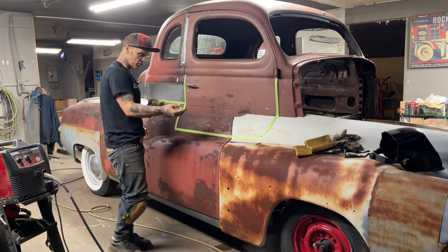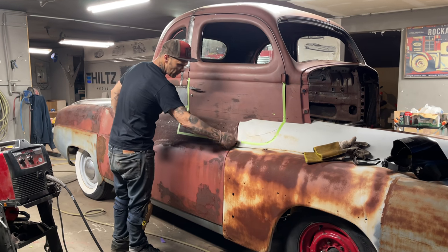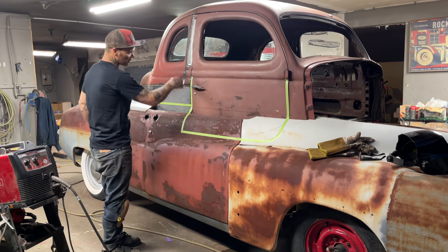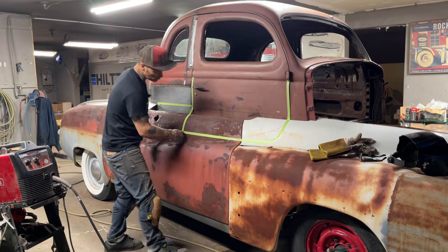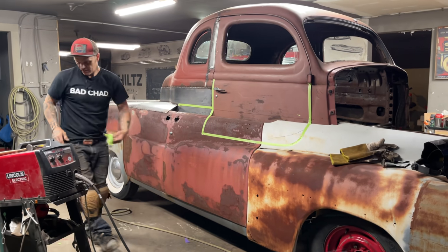Then once I'm done, I have a weld mark there, a weld mark there. I'll release the skin from the door here before I weld these two together. The square tubing will be cut out of there, so the door, as soon as I open the zip cuts, it'll open. But soon I just take a plasma cutter and I'll come down here and cut that open, go along there and cut that open. When the door opens out, then I'll figure out how to cap that all to make it something.